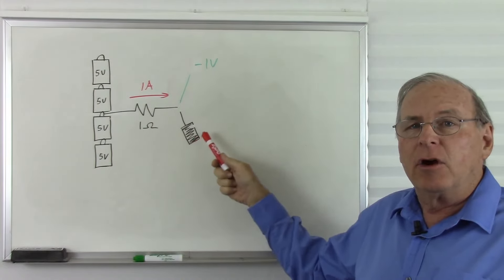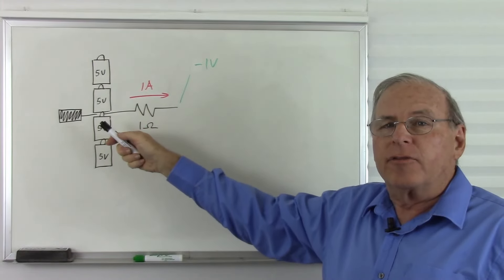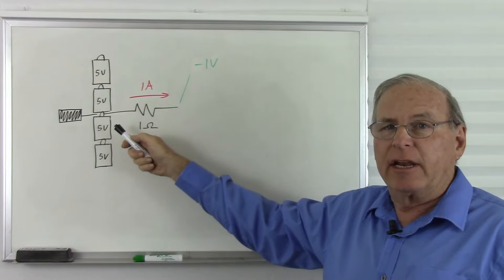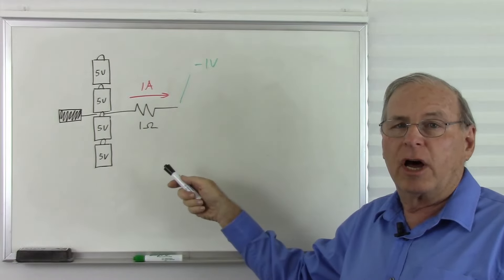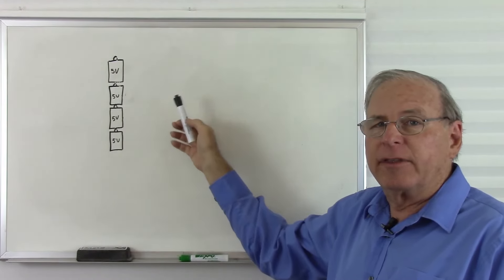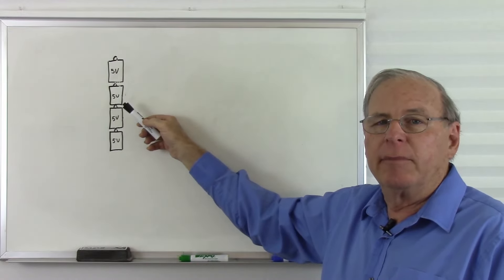I need to get my black lead over to my correct ground. Now, since my black lead is anchored at a place where my voltage will not change — and we've designated that as zero volts — even as my current increases and this voltage goes up and down, the other voltages in the circuit will not follow it.